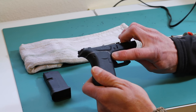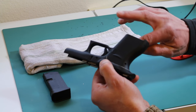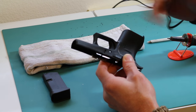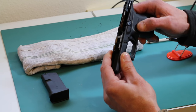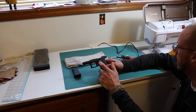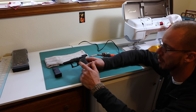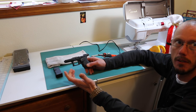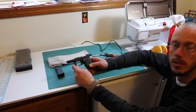The white line is the grease pen marking. This side and that side are pretty close right now — I'll spend some extra time making sure both sides match, then come all the way around the back. The minor texturing on it will melt away so I'm not worried about that. It's got slight indents on both sides that I'll texture right up and over. Nice thing about this pencil — a lot of painters use them — if you make a mistake you can just wipe it off with water and start all over. When you start melting it, the pencil basically melts too, so you don't have to worry about washing it off or it getting stuck in the stippling.